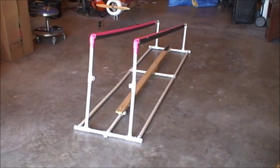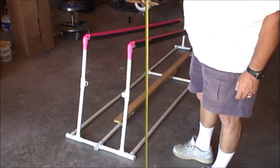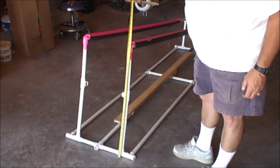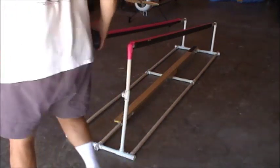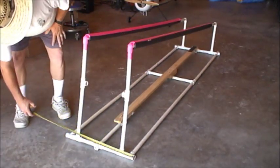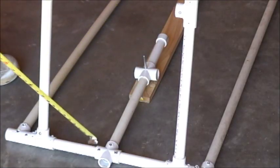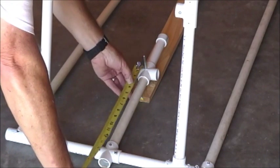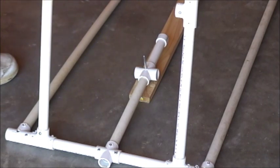The dimensions are not going to be absolutely critical. The total length of the front is 29 inches. The width on the front is 23 inches. This piece holds the trigger to the front crossbar, and the trigger pin is 13 inches from the front of the crossbar. This is just a four-way PVC — all of the PVC is three-quarter-inch Schedule 40 PVC.